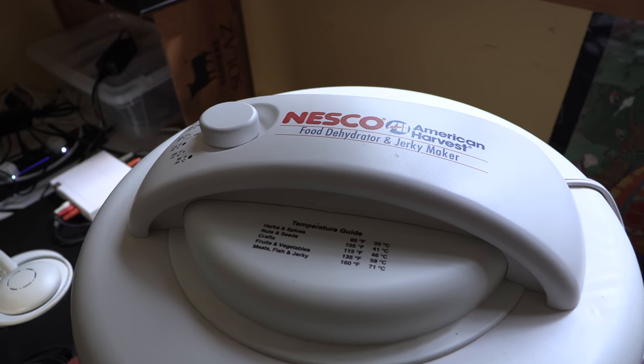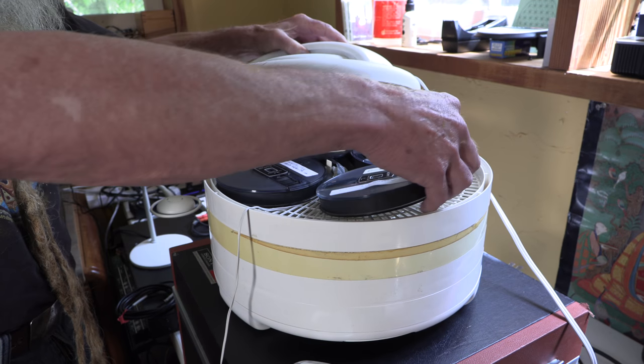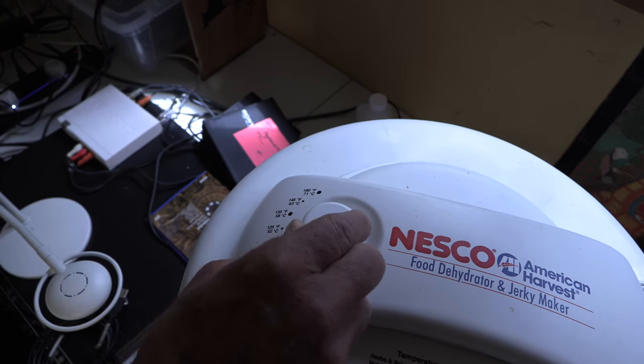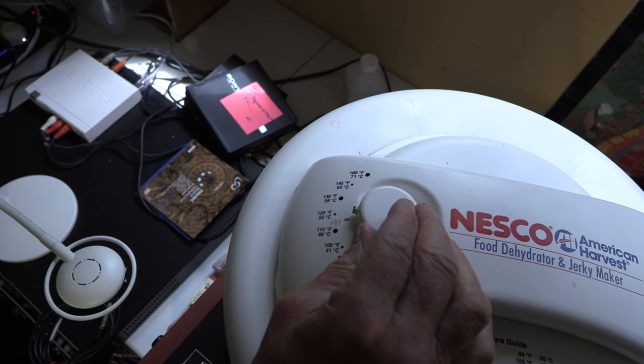And what we found in our research of this whole process is that the best thing to do is to bake the tapes. The old tapes that were made from the early 70s to 1985, the half-inch tape, needs to be baked for approximately 5 to 6 hours at about 130 degrees. If you go over 140, you could possibly damage the tape itself. After it's been heated up for 6 hours, you let it cool for at least 6 hours. And then after that, you can play it back.